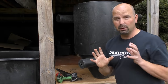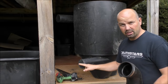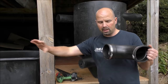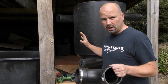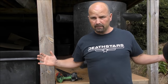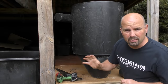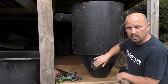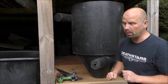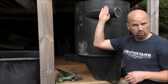I'm going to put something in here which will aid in that settlement as well. First thing to do is put a fitting on here, which is the inlet. I'm going for rubber — rubber four-inch fittings — and that will take a four-inch solid pipe. I'm not going all solvent all the way through because I may want to jig this round at a later date. I may even want to take one or more of these out in favour of a big drum filter. Having rubber fittings will give me that option to change it later. The outlet needs to be cut off just with an ordinary wood saw — it doesn't have to be particularly sharp.